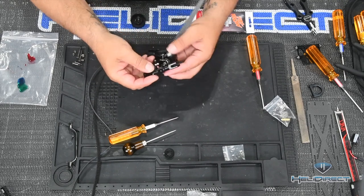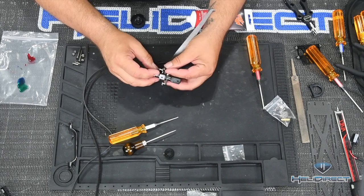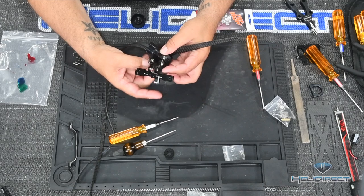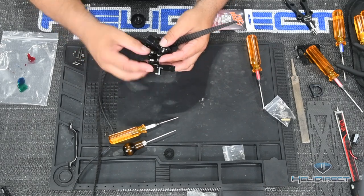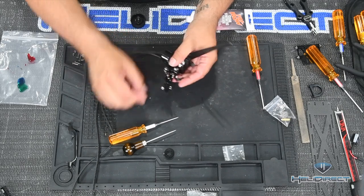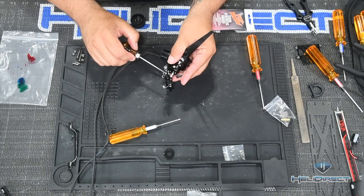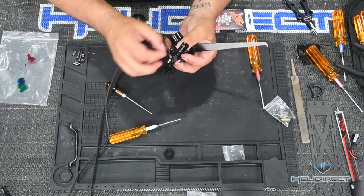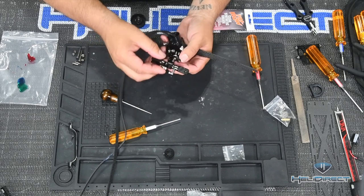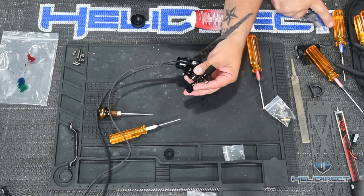We're going to take our pitch control arms and link them to our servo balls here. First, make sure that it's still in the track and the pitch slider's moving up and down, and that's all set. That little number one, remember, that was on the outside of our pitch links, needs to be on the outside of the link. So the side that clicks onto the servo ball should be the side without the number one, okay? That's very important, so make sure you get that right.